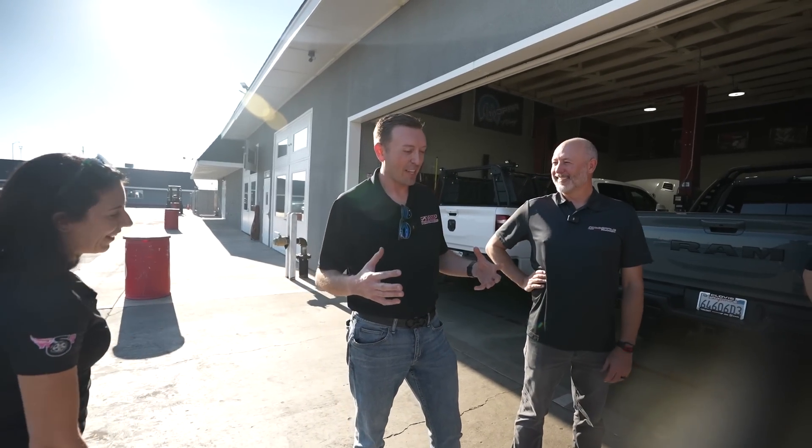Are you confirming what I have long suspected — that Ford customers modify their cars the most? Oh absolutely, no question — I don't think there's anything even close to it. We've been totally thrown to the fire and met the demand to produce a really nice kit. It's cool to know we've got over the hump and now we've got you guys as a partner with access to all your kits for all makes and models. Once we went single inlet, we were able to tilt it at a better angle to actually outflow our 132 and 150 millimeter throttle bodies — not only dual filters, but improved efficiency to the supercharger by directing air more directly at the rotor. I love that round throttle body — much easier to tune around.